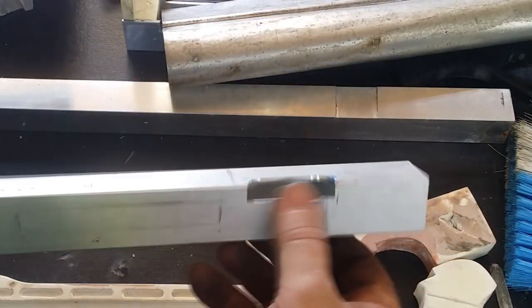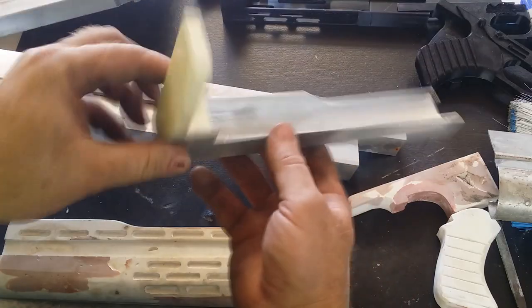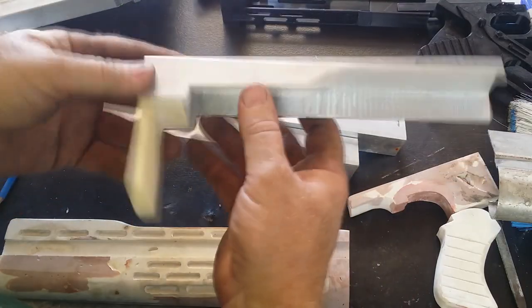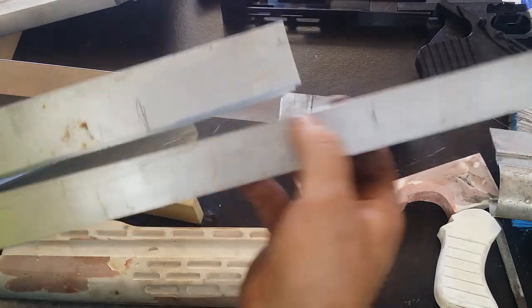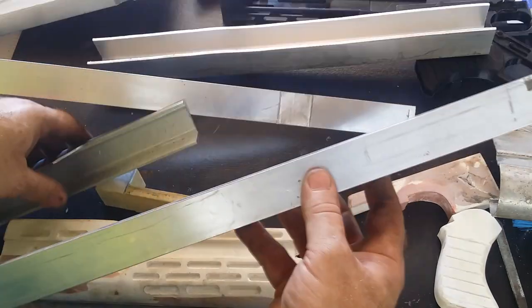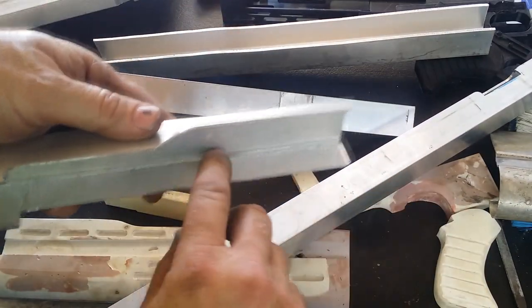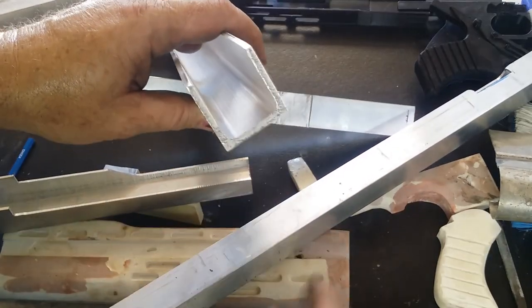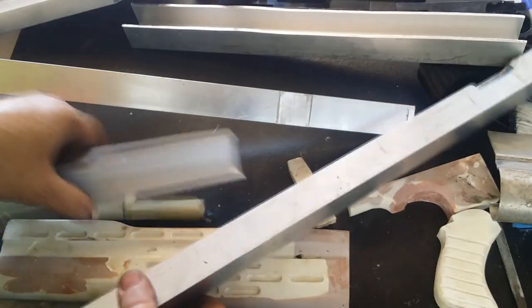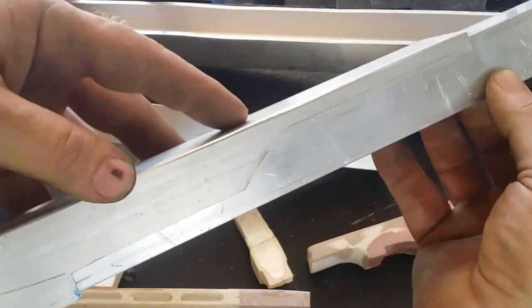The construction slowed down a bit whilst I've been doing some experimentation to work out exactly what I can produce in terms of the parts. On the milling machine I've worked on starting out that tailstock piece. This is a piece that wouldn't normally have fitted over that top piece of the Thompson cocking mechanism, but I've been able to use the mill to mill out that inside surface so that it's an appropriate fit, as well as removing the rounded corner you can see in there, which means it will fit over the top and slide to become the extendable shoulder piece.